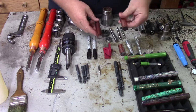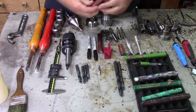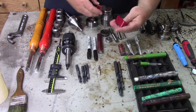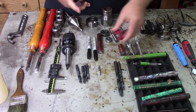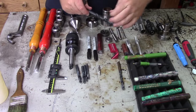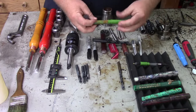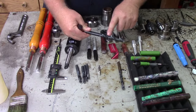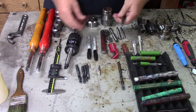We're going to grab our cap piece and take it to the lathe. One very important thing is we want these faces square. I cut this one on the bandsaw and it's not quite square — I can see a little gap with my center finder. So I'm going to square this up, then drill with my drill chuck and the large bit. I've marked the bit to show how deep I drill for this particular size.